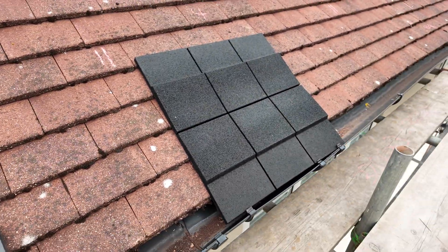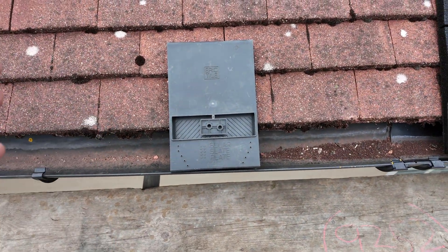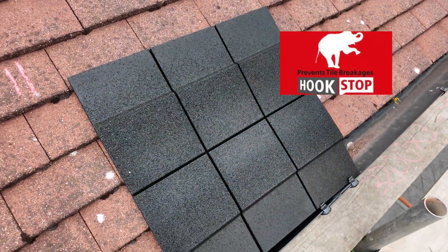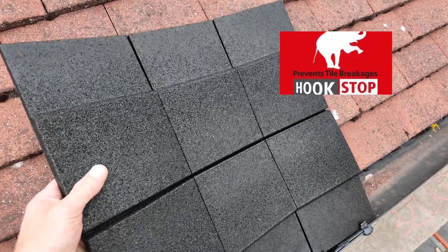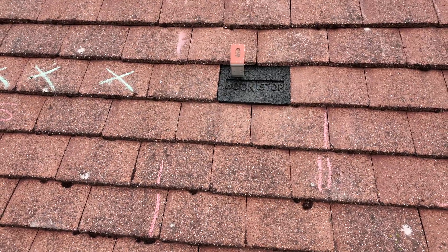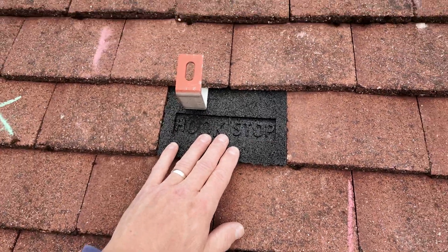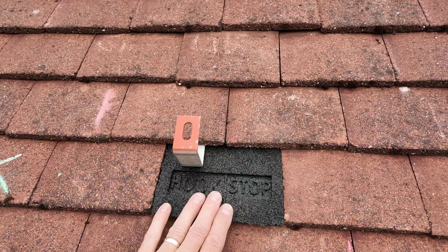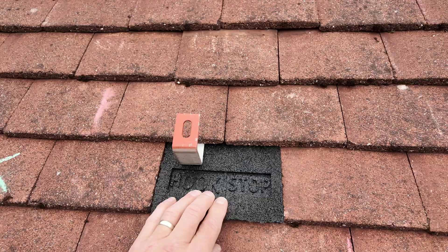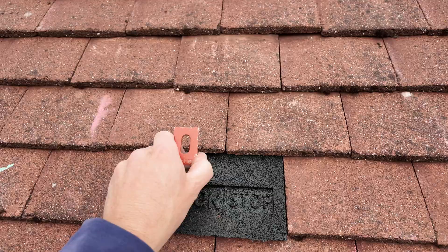On this job, because of what's gone on with MCS and all that ridiculousness, we're not entirely sure if we can actually use the Eric tile on an MCS job. So we're going to look to use this — we've seen it before, we've used it before, many people have seen it before — it's called a hook stop. What you're looking at there is actually a rubber type. We've just quickly dressed one in; we haven't screwed it down but we found the rafter underneath. The whole idea is that this taps onto the batten underneath.